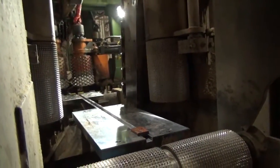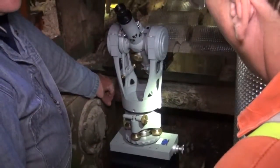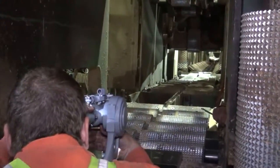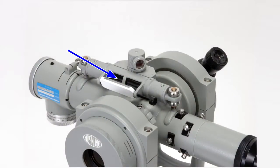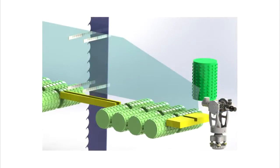Before aligning to the reference points, the instrument must be rough leveled. This simple process sets the instrument's vertical axis nominally parallel to the force of gravity — nominally meaning within five arc minutes — and prepares the telescope to be aligned with the reference points. Our goal is to sweep a precision vertical plane within plus or minus one arc second, which is 300 times more accurate. This is accomplished using the coincidence vial mounted on the telescope. The bubble works like any other level, but the operator views a folded image of both ends of the bubble. When both ends are brought together — in coincidence — the vial is dead level, allowing the instrument to sweep precise horizontal and vertical planes.